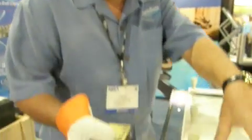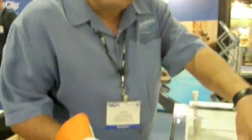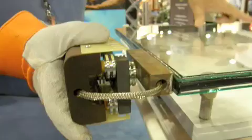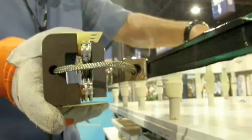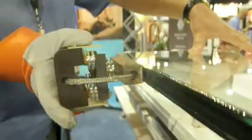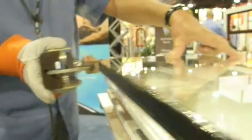It's easy to use. You start about an inch and a half, almost two inches in. You let it warm up just for a second, then you push and plow a little bit of the hot melt into the corner so you have material from where you come back around. Then just pull across and you can see how it's sealing on the edge of the glass, reaching your barrier. Basically, there's nothing to it — just that easy, forming a perfect edge sealant.